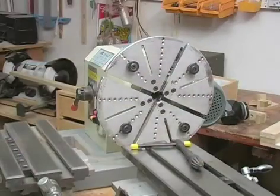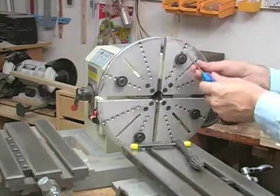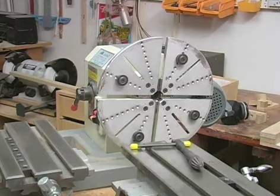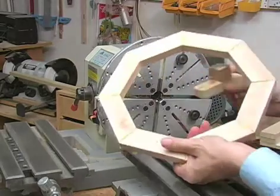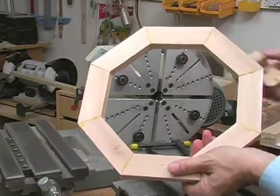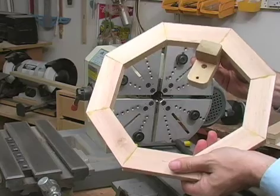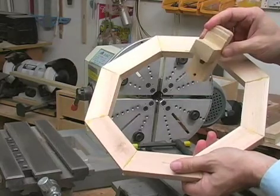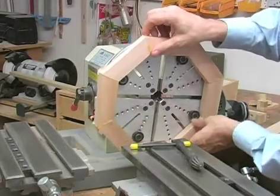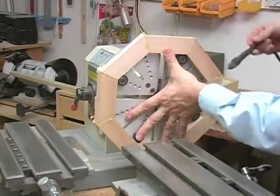Now we're going to turn our attention to the chuck again. As you can see, I've put the rubber feet on. This one I'm just finishing up tightening. And one really important use for the rubber feet is if you're making a block rim and you can't really use the inside jaws to face off your piece. Facing off means just do a skim cut to flatten it completely, because it's just too tall. The tool bit is going to run into the top of the false jaw. So the rubber feet are really helpful in that if you have several layers to face off, you can quickly run them through the process.